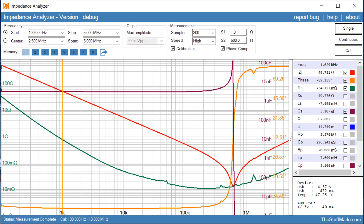Depending on voltage, you might not have the capacitance you thought you did. Anyway, this was just a quick look at adding an external bias voltage. There's really no limitation here — you can use 100 volts if you want, if you have a power supply that can deliver 100 volts DC. The only requirement is that it has to be fairly clean voltage, otherwise it's going to mess up the measurement. Thanks for watching, and I hope you're having a nice day. Bye-bye.